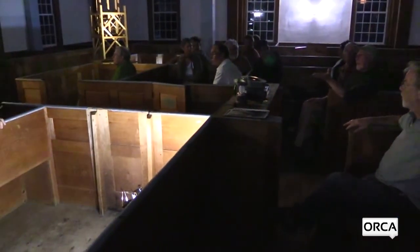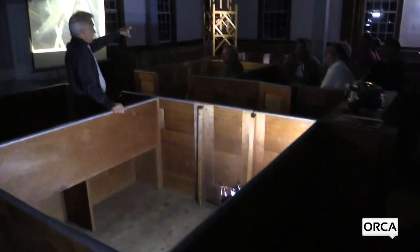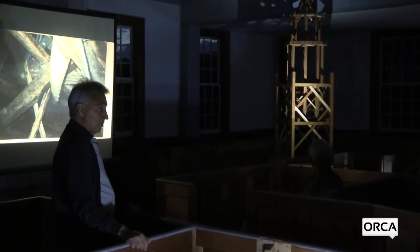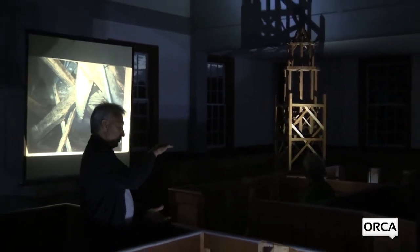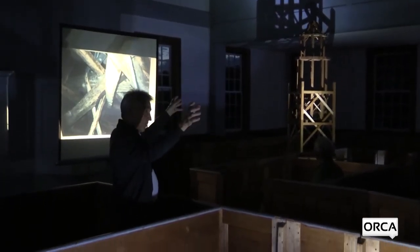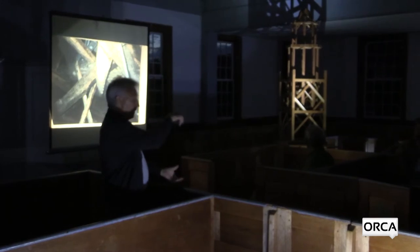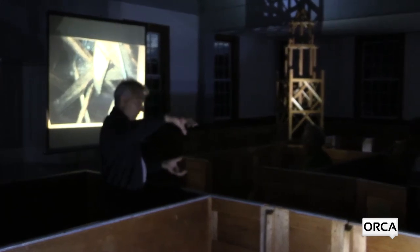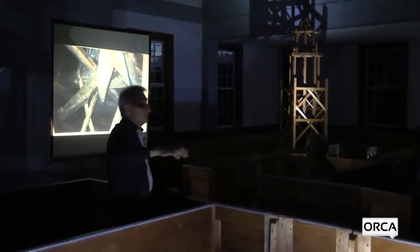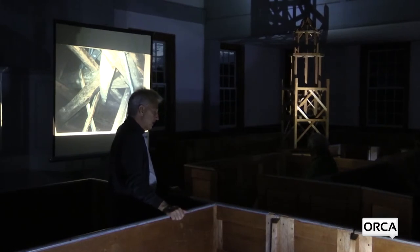And so beyond the mast, what else do you see? Well, I had that out of there. I build up new bearings on top of the existing bearings, more or less, for the 8 feet of the post. Posts are all 15 inches off the frame where you'd think they should go. Two of them are 23 inches off it because they run afoul of the braces. I might build it up out of like 3x15 plank and build a frame that comes up to those points, and then run like an 8-inch timber across that, and I would pick up the ones that are 23 inches short and try and work them in around everything up there. I think that's the main other thing I do.